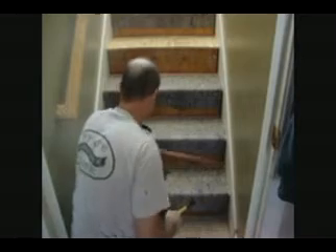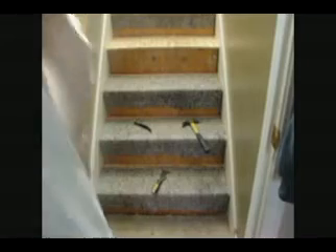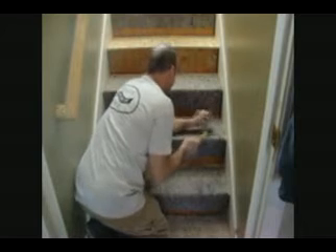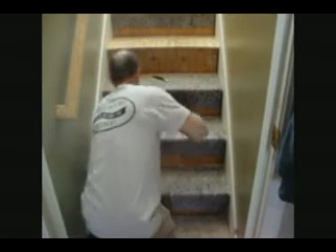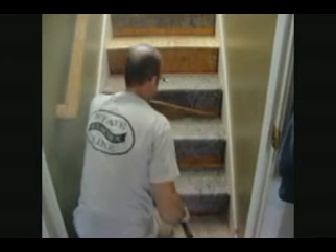And there it is. You can wear gloves if you want — I did when I pulled the carpet out. Basically, I've got my box set up to hold all those strips so I don't have to run into them again. I'll do another one — start over here. Slip underneath it, pop it. You just go evenly across and you won't break your wood. I'll just repeat that until I get them all off.